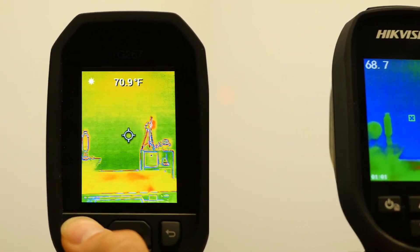On the FLIR you get a bullseye laser — that's a center dot and then a circle describing the field of view at that distance — which can be very useful to know when you need to change your distance to target to get a good temperature reading. On the Hikvision you just have a single point laser, so you know what your reticle is targeted upon, but the bullseye laser does give you a much better indication of what you're actually taking a temperature of.